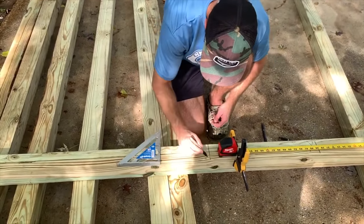So now that we've framed the entire shed roof, let's install the plywood roof sheathing, which is gonna be the decking that we install the asphalt shingles on in the next video. To actually install the plywood roof sheathing, I put 2 or 3 sheets on top of the roof just so I had a surface to walk on. And after putting a couple sheets up by kind of just shoving the plywood in over my head, I climbed up on top of the roof and I got the sheets of plywood positioned as shown here.